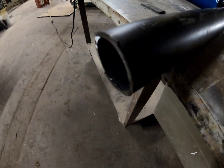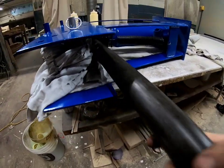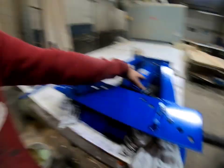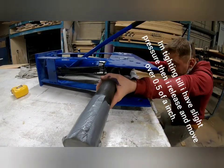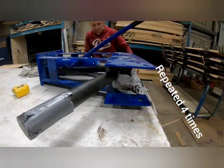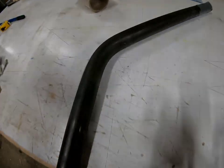Look at that cut — that's just with the grinder, it's almost like I knew what I was doing. I'm putting my mark towards my left so it should be right there. We're going to do this in steps so it doesn't get kinked — this is a hydraulic press so it can be relieved and pressurized very easily. I just took it out of the bender and there's nothing wrong with that — it looks like it came out of a mandrel bend machine. I'm going to put it in the car and see if that's the angle I need.